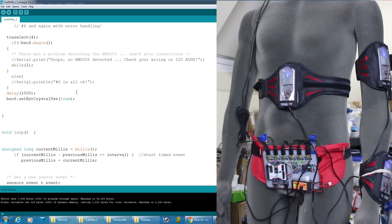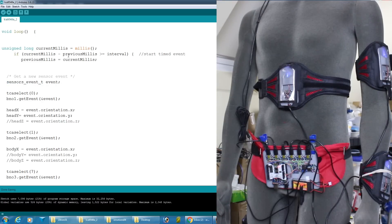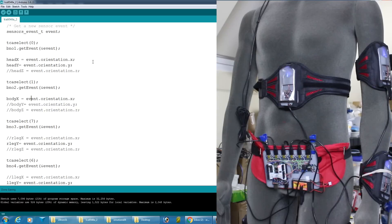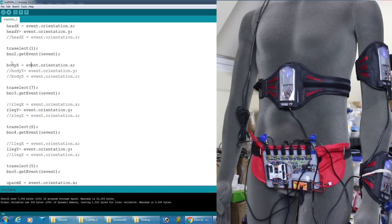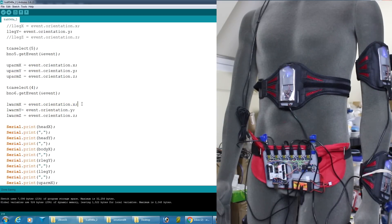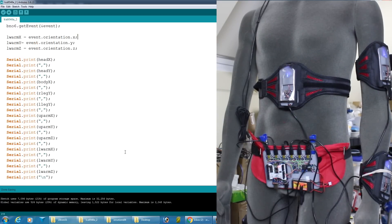There was some trouble having to initialize the sensors twice to get them to work — that's covered in one of the very early episodes where I played around with the motion capture suit and built a test arm. I'm running this with multitasking at roughly half the speed of the receiving Arduino so it doesn't overflow the buffer — running every 80 milliseconds. Essentially I'm pulling in the event orientation XYZ axis from the different sensors. For the body I only need vertical rotation; for the head I've got two axis; and for each arm I've got three axis.